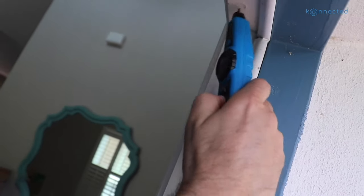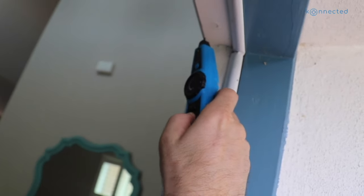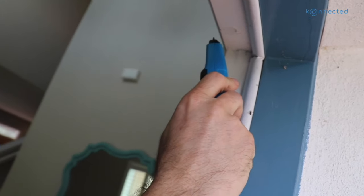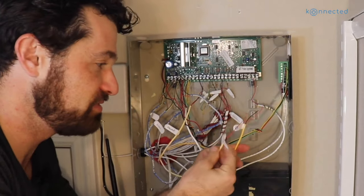Now we'll use the wand and go to the door, wave it around the door frame and wall, and when we hear the tone, we know we've identified the right wire. I'm at my front door with the toner going upstairs. This works best if we open the door and find where the sensor is — usually it's embedded in the door frame, looks like a little disc. I hold the toner near that, and you can hear that tone loud and clear. That means I've identified the wire. So now I know this one's the front door wire and this one's the garage entry wire, and I've labeled them accordingly.